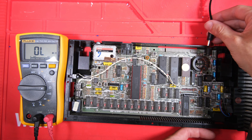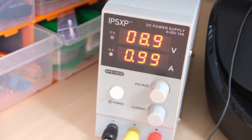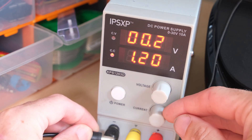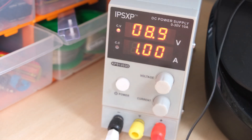With that checked I'm going to measure the voltages, and I am using my current limiting power supply which is maxing out at 1A - that's because I haven't got the setting quite right. Let's adjust that and increase our current limit a little bit, bearing in mind the 7805 maxes out at 1.5A. I've set it to about 1.2A, and at 9V we are drawing 1A.